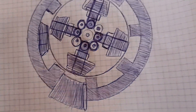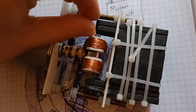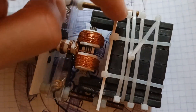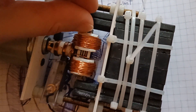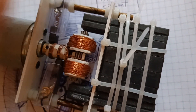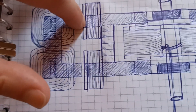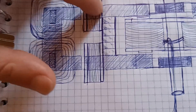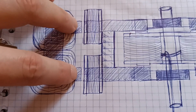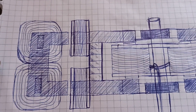Getting back to this original generator — I cut the pole pieces, and my idea is that because they were longer, the coils had a chance to oppose the flux from the magnets. There is iron, so there will be a magnetic zero spot in the iron — it's north here and north there, they oppose, and there will be no attraction of the iron at some point. So in the new design I've left a piece of iron on this side and on that side, so there can be a non-attracting piece of iron. When you do nothing it's going to cog a lot, and when you generate it will oppose so the attraction is cancelled out — that's what I'm hoping to achieve.